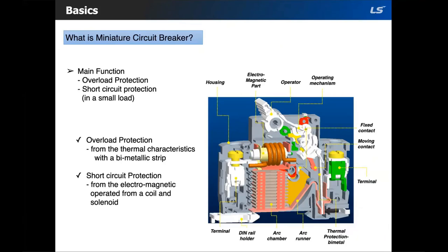There are two mechanisms of operation for an MCB: the thermal effect of overcurrent and the electromagnetic effect of overcurrent. Thermal operation is achieved with a bimetal strip. Whenever continuous overcurrent flows through the MCB, the bimetallic strip is heated and deflects by bending. This deflection releases a mechanical latch, which causes the mechanism to open the circuit breaker. During a short circuit condition, a sudden rise of electric current causes electromechanical displacement of a plunger associated with the tripping coil, striking the trip lever and causing immediate release of the latch mechanism, opening the contacts.